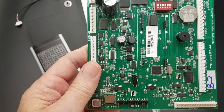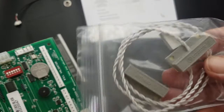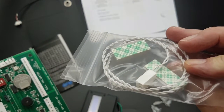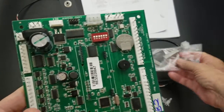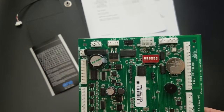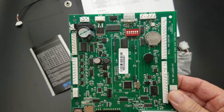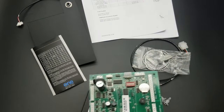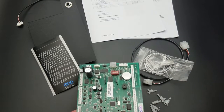To prevent that problem, the door switch is included in the kit. It's basically a reed switch — a magnetic switch — and it mounts to the door and cabinet. As soon as the door is open, it triggers the controller and lets the control board know the machine should be in service mode, which prevents the board from doing a periodic motor scan. However, the door switch is a part that could easily get jostled or knocked off the machine.